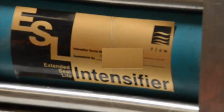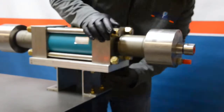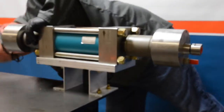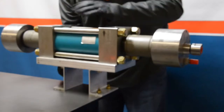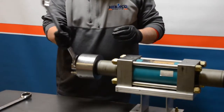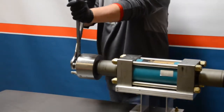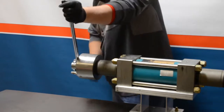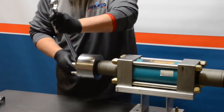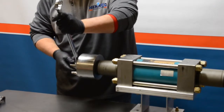When we're doing our work, we like to use the benches typically provided by Flow, utilizing the screws and threading into the appropriate parts. We start typically with the output adapter out of the check valve using two wrenches — both inch and a quarter. We use the two-wrench technique to break free the output adapter from the check valve body, then spin off the output adapter and set it aside.